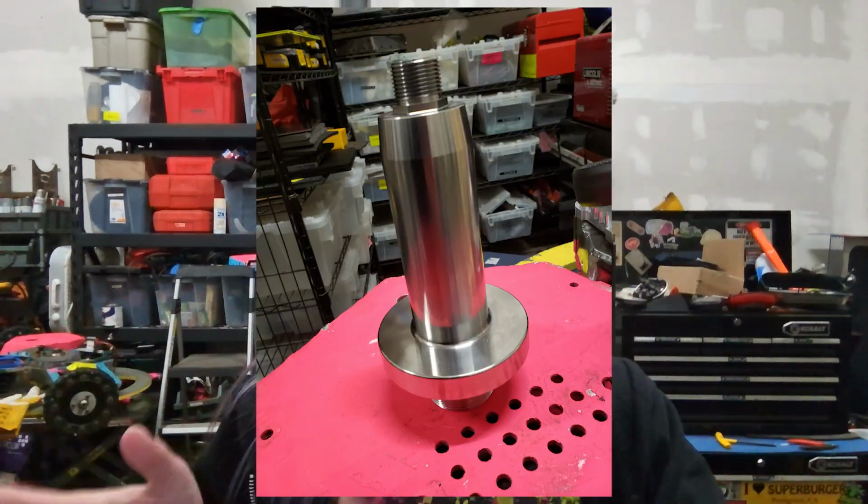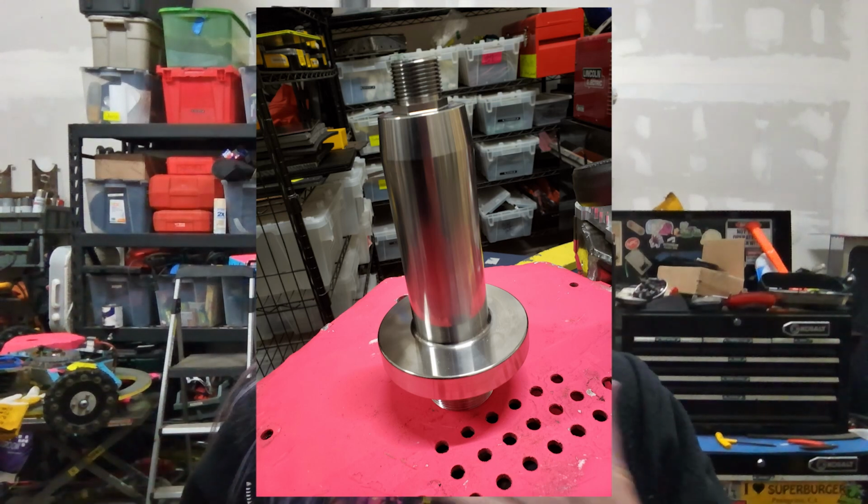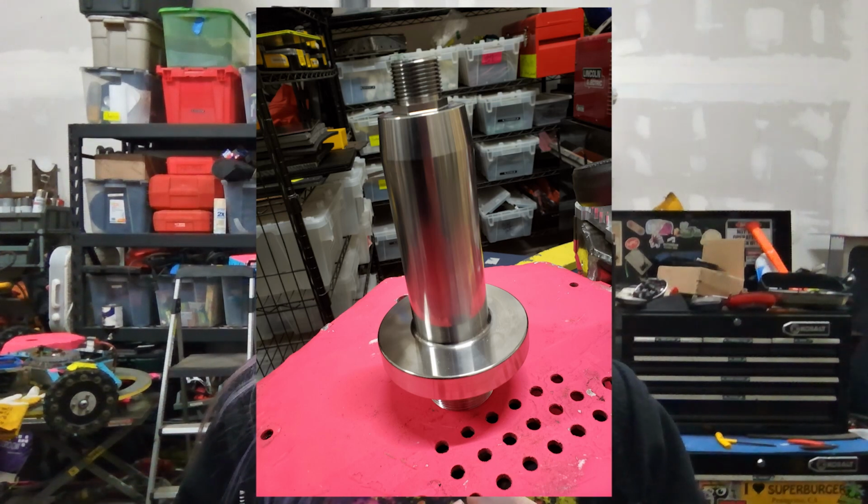So there was an opportunity here to move from a 4140 weapon shaft, which is adequate, but out here by the ocean, they were literally rusting in the shop, adding friction, and friction bad, and move to a 17-4 PH stainless steel weapon shaft, which is more resistant to corrosion, higher chromium content for a slippery smooth bearing surface all the way down, and better strength.